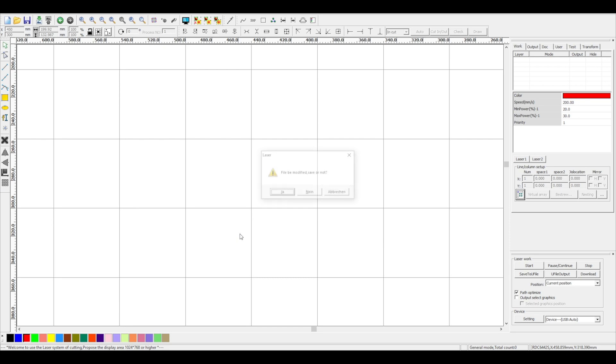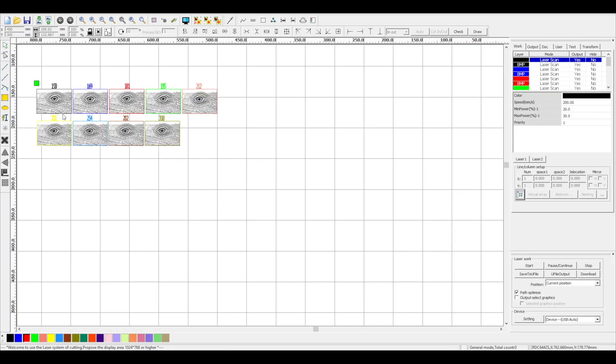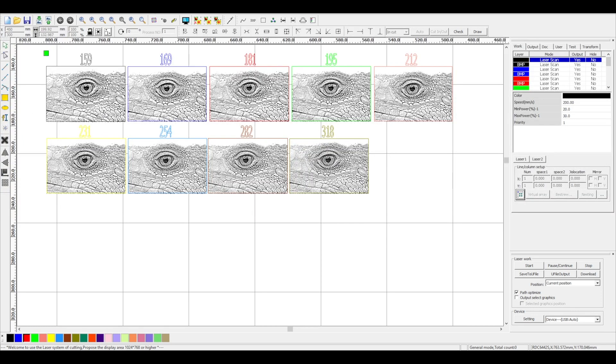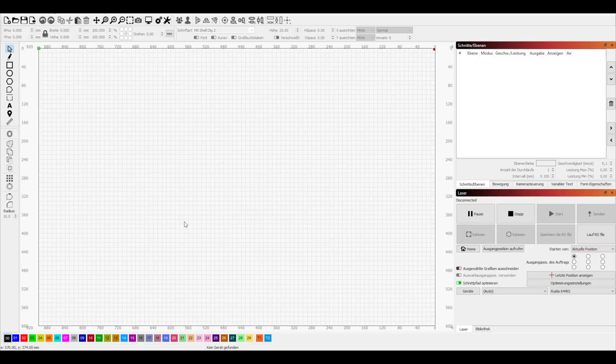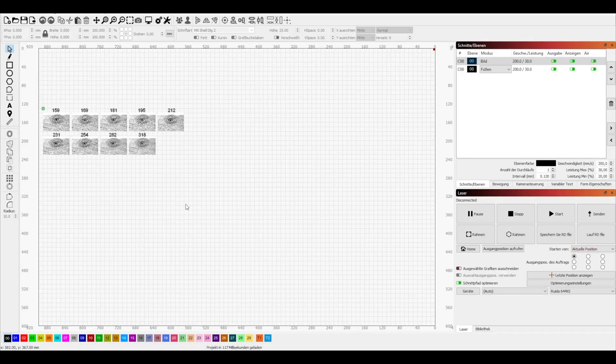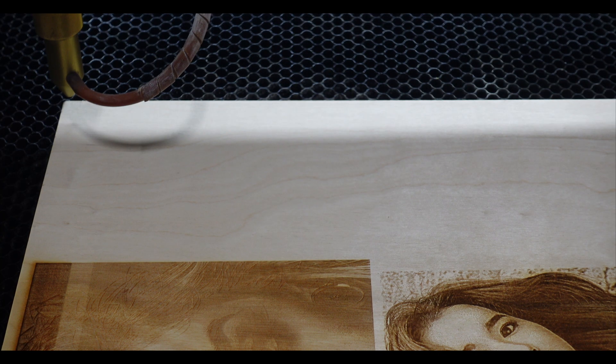Now we will open the test pattern I created. I will run it with RDworks. As you see, there's always the same cropped image from 159 to 318 DPI. All values are already correct — you have to change speed and power. I ran this on my ADW CO2 laser. Do not mess with the colors, since it will change the step size and mess up everything. If you're a LightBurn user, you can download the same pattern also for LightBurn — everything is in the description. Now let's start the pattern. We are looking for good shading, no visible dots, but still all details.